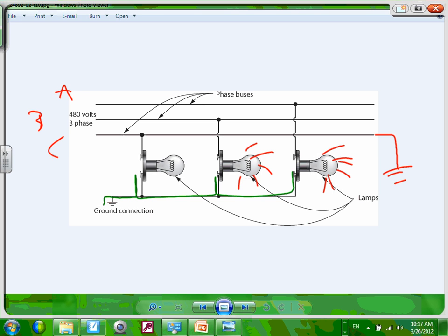If the voltage is to go on phase, let's say in phase A here, it was in phase C before, then this will go on, and where's phase A? Phase A will dim. Now this is a visual indication that I have a ground fault in phase A. Who cares? You can tell your maintenance guys, by the way, when phase A, nothing will happen. Your system is up and running.